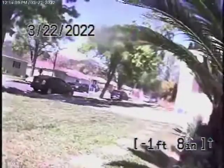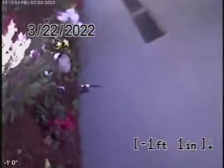So the cast iron pipe is getting very old under the house. The ABS that we saw was all in good condition. We're going to recommend the line be hydrojetted and re-inspected so this inspection can be complete. Here we are in front of the house. There is the clean-out. We're going to go ahead and stop the recording here.